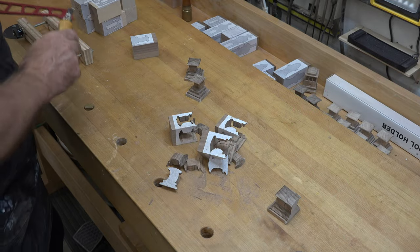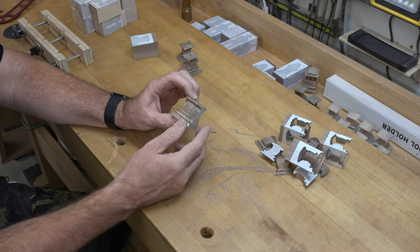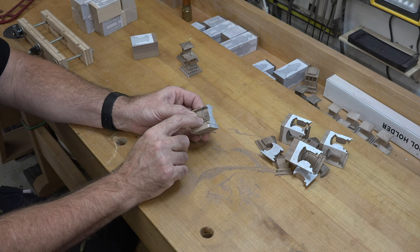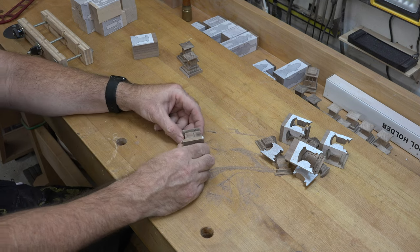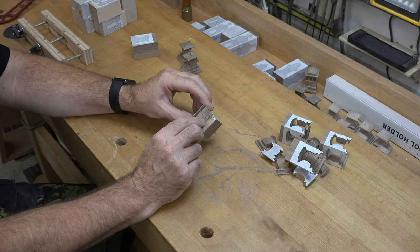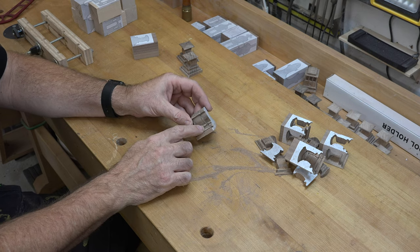Well, I just wanna show you something here. Sometimes on these compound cuts, especially with thicker stock, when you start peeling it apart, it may not separate. Now that can happen when, for these pieces here, I cut them around this way and then stop in the corner. And then I backtrack and cut this and join it in the corner. And if you're putting too much forward pressure on your piece, when you get to that corner, you can be flexing the blade from front to back. So when you come into these corners, just kind of ease up a little bit on your pressure and let the blade catch up when you get to the corner. But it hasn't cut through all the way.